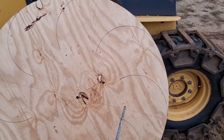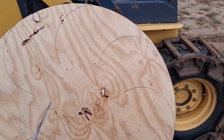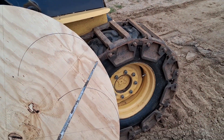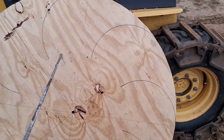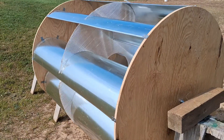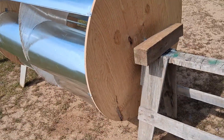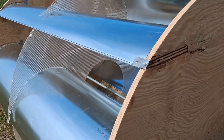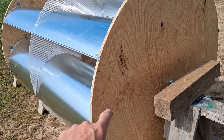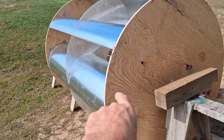This is the blade pattern I chose to work with — these black lines of eight curved blades — so they'll catch the wind and force it towards the center. This is one of the end plates. This is intended to be a vertical axis wind turbine right now, and the construction is of two plywood circles. I cut these out of one sheet of plywood so they're four feet in diameter.